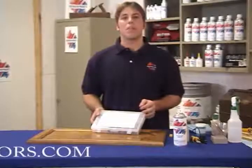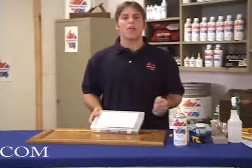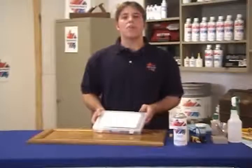A poor choice for a burn-in, for example, is the bottom of a chair leg, because it will take a lot of impact. The shellac sticks are durable, but they are brittle, so it will shatter. Let me show you what I mean.